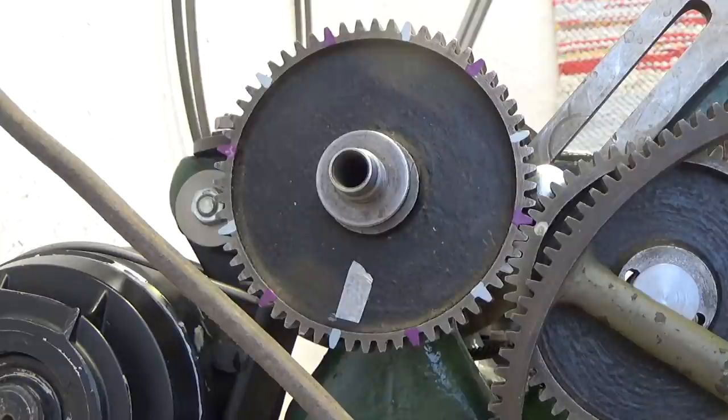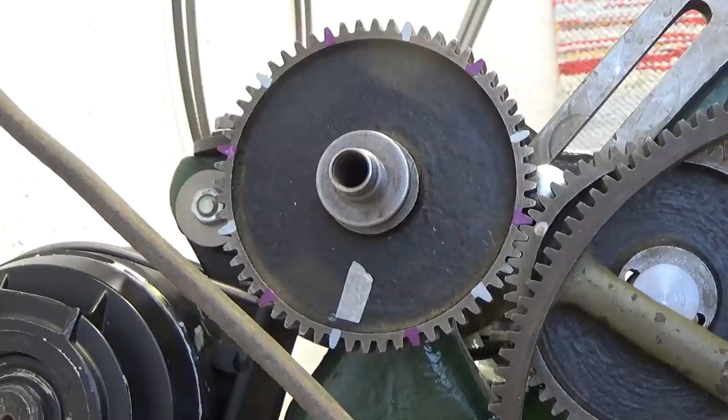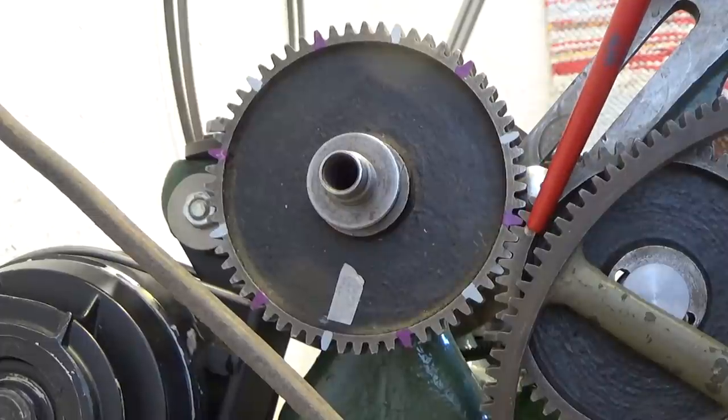To make multi-threads, you need a dividing head. I use a gearwheel mounted to the headstock as a dividing head. In this case it's a 60-tooth gearwheel. As you can see, the gearwheel is marked with 12 marks all the way around, which means that I'm able to cut worm gears with 6 teeth or 12 teeth. When one tooth is finished, I move the gearwheel — take it off, turn it to the next mark — and that corresponds with this gearwheel.